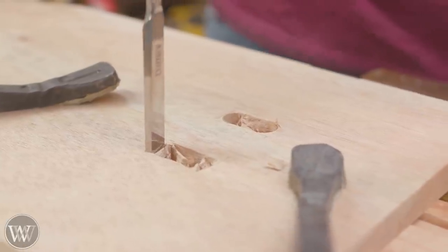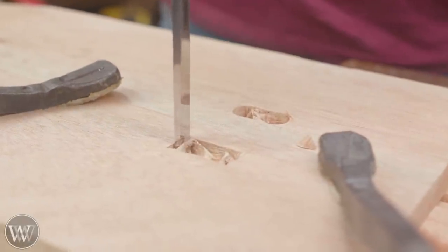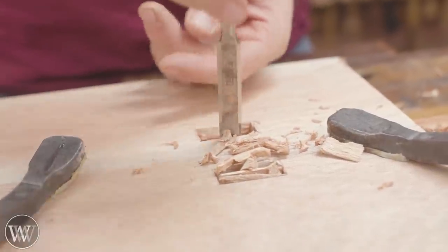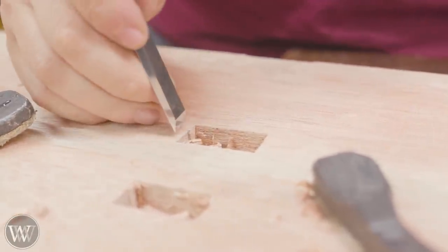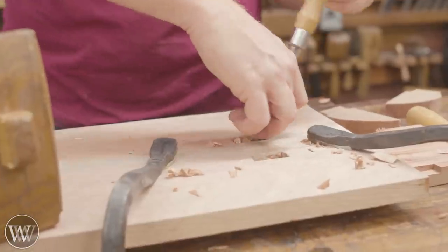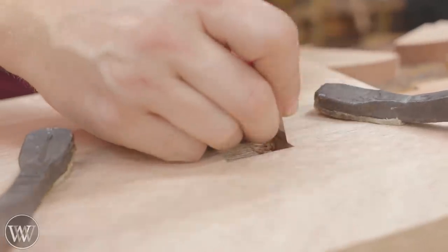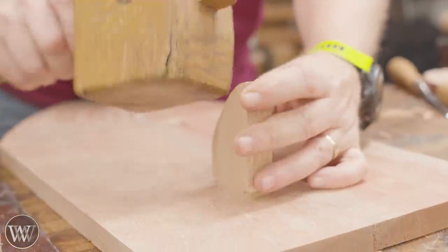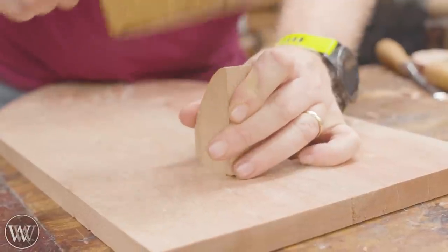Now we've removed most of the material, so we can come in and chop it out. With this mahogany it is such a pleasure to work with — it chops out just beautifully. A good sharp chisel goes right through it. One thing you have to be careful of: you can't have a dull chisel in this because it will crush the wood — a lot like pine, it will crush rather than slice. So you have to spend a little more time sharpening your chisels. A good soft wood requires an incredibly sharp chisel. I put a sacrificial board on the back and cut straight down all the way through from one side, and as long as my cuts are vertical it should slide right in and fit just the way I want it.